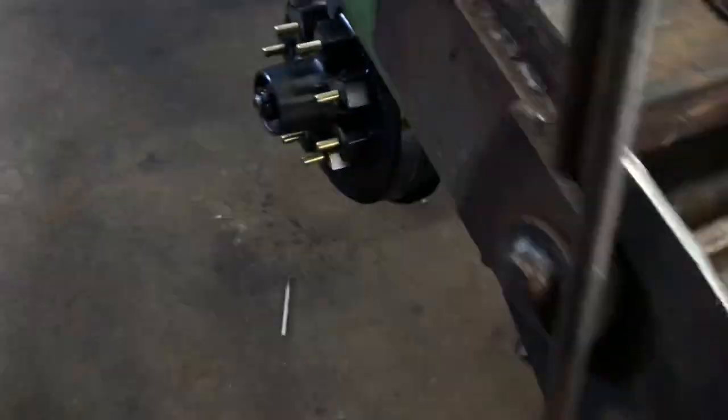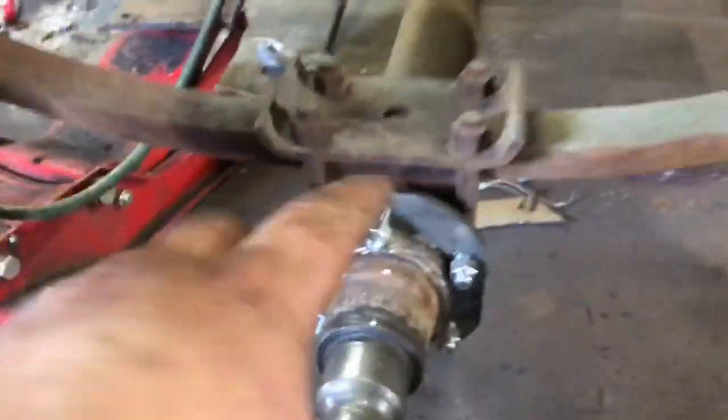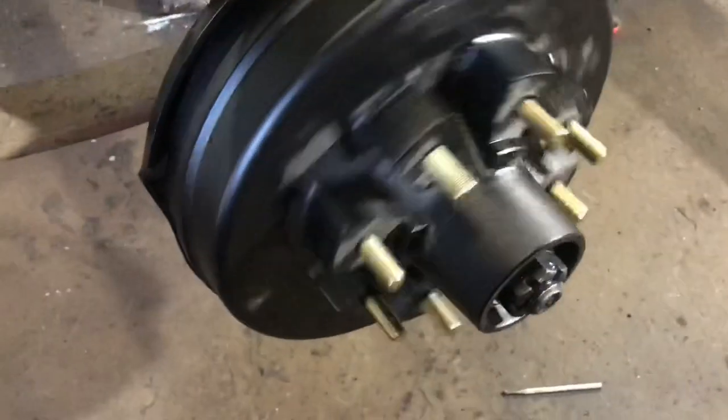Tires are off — the old ones — and that was easy because they had been off before. I wanted to see what kind of bearings I needed. Here are the assemblies I bought, and hubs along with the backing plate to bolt the brakes onto the actual axles, plus new bearings for everything. I've already got a little bit done on this side to make sure everything was going to work. I got this tacked up, and I'm going to drop the U-bolts on both sides, drop the whole axle out, then weld a good bead on the back side. Everything's set up — I got this one tacked as well, but I still need to adjust the drum brake spring.